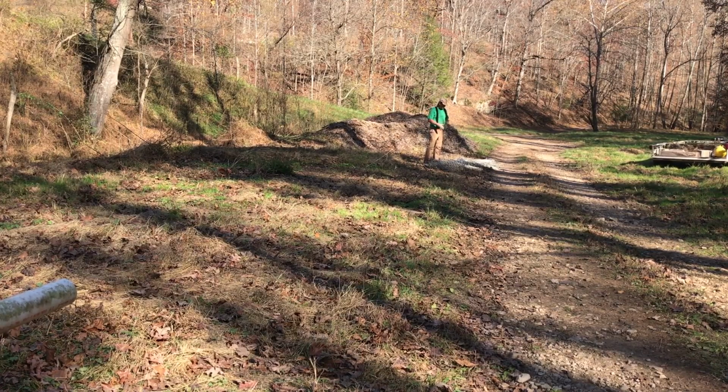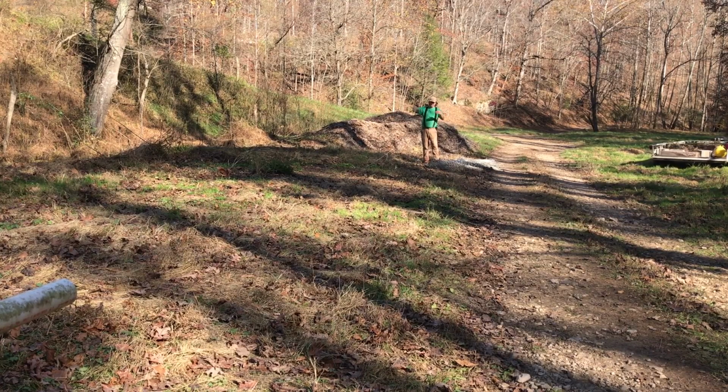Then I start to stretch this out on what I think roughly is my back corner. If I stretch it out to the corner of the greenhouse where the camera is sitting, then that should give me a pretty good idea to say, okay, that post needs to go here. Then that should line me out. If I just started at the front of the greenhouse and just came out arbitrarily, I could stick everything in the ground and end up short. I'd be like, oh, I got to come back and make these corners closer. Or I could come back and wind up extra long. Now I got to come back and pull everything up and bring them back around.